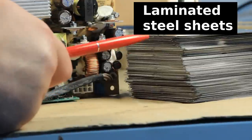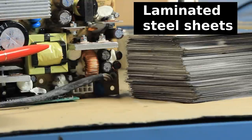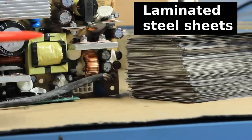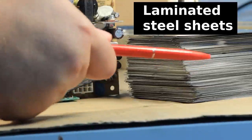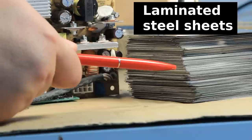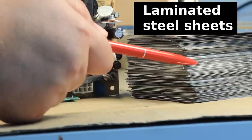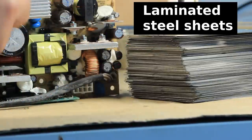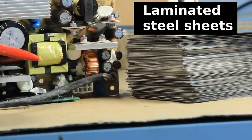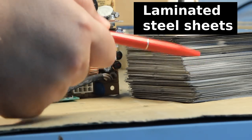In comparison to the long spring, the small short spring oscillated at a much higher characteristic frequency. That is exactly what we are doing in a switch mode power supply — we pump in energy at a very high frequency compared to the traditional 50 or 60 Hz transformer. Here we pump in energy at about 50,000 Hz instead of just 50 Hz, and this is how we can pump through the same 250 watts through this tiny small transformer compared to this huge heavy bulky transformer.